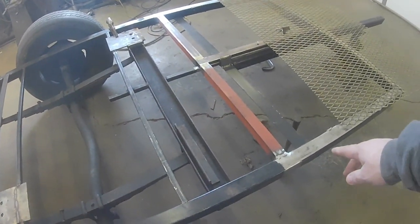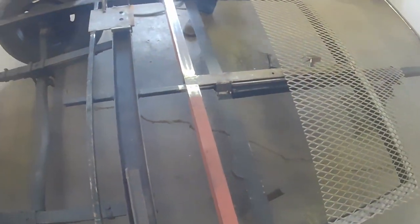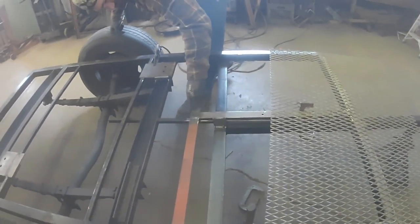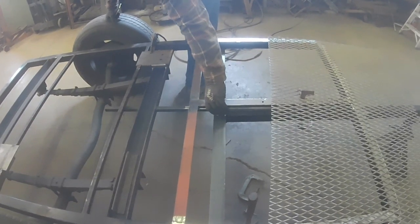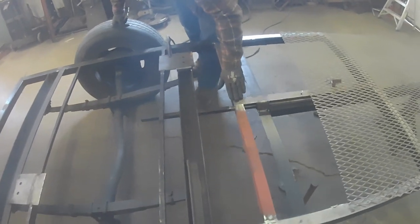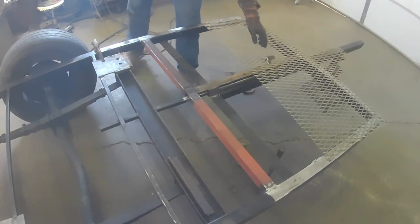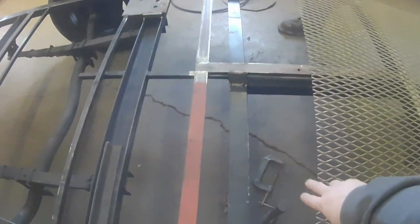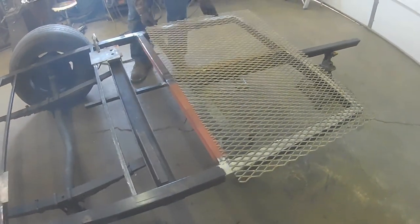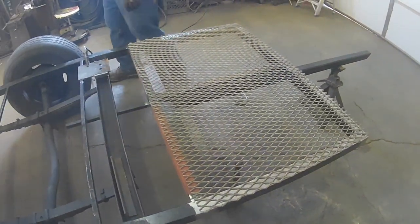He has created this brace. You can see the red, you know, fancy. I gotta come around this centerpiece right here. I'm gonna weld all the way around, strengthen this area. I've got support here, just in case there's any weight put on the back side of this. I want it to be good and strong with the weight of the trailer since I did splice pieces here. Anyway, we've made that support because it's going to be part of this shelf basket, front of the fuel trailer.